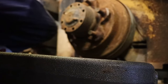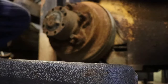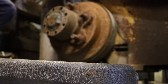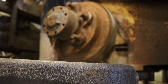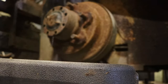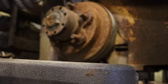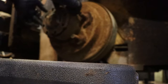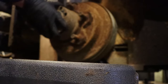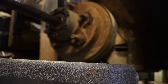I'm starting to smell gear oil now — it's not very good. I've got a drip pan set up here, and I've got a two-pound hammer to try to get this axle out. Oh, it's water. That's not good for the bearings, is it? I guess we're buying bearings for this.